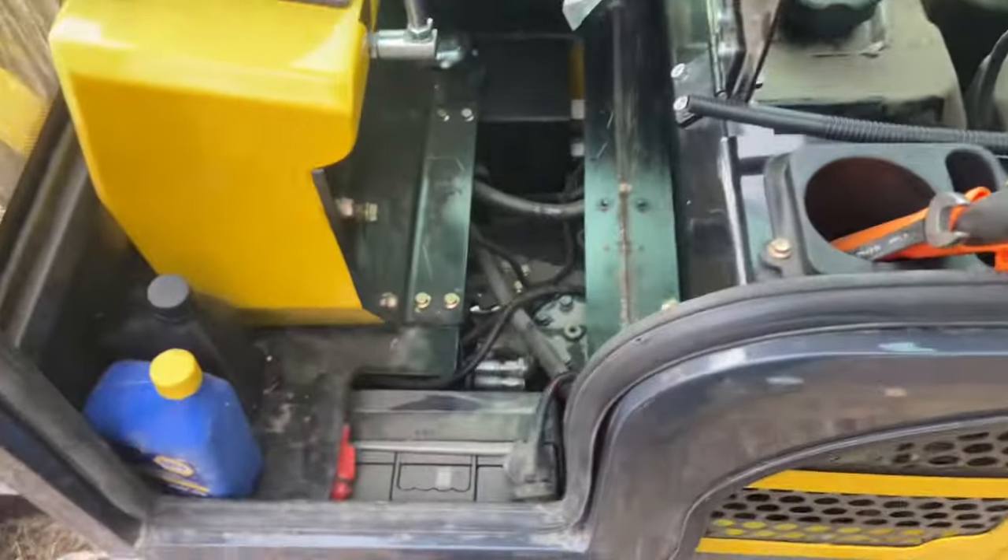We're all greased up and good to go. Grease points: there are four down here on the swing. I used the needle-style grease tip — the one that came with it. If you have a little toolbox that comes with a cheap grease gun, replace that right away. Both ends of the cylinder have a needle fitting — you can trade them out to a standard grease nipple if you want. On the arms where they pivot there's a standard grease fitting, and then you have two remote lines for greasing the turntable underneath. When you pull the floor pan out, double-check those lines aren't broken — they like to break, leaving you with a big pile of grease in your floorboards and a very dry swing bearing, which gets expensive fast.